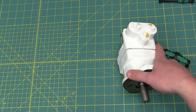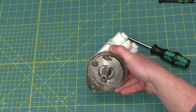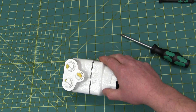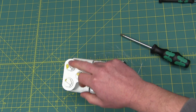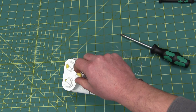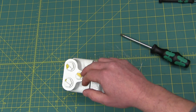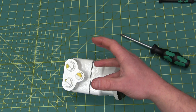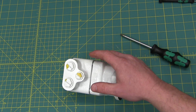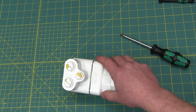Having a quick peek at this, we can tell it's an SAE two-bolt flange — maybe an A or a B — and just a keyed shaft. It's gotta be a motor because the inlet and outlet are the same size. What type of motor? I'm not sure what this third port would be. Very likely a drain port for bypass leakage, to allow any internal leakage, which is completely normal — because in hydraulics, motors and so forth, the oil is actually providing some sealing. So there's some design leakage there; we allow that to go back to tank. That also provides cooling.